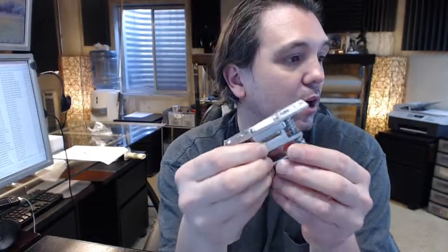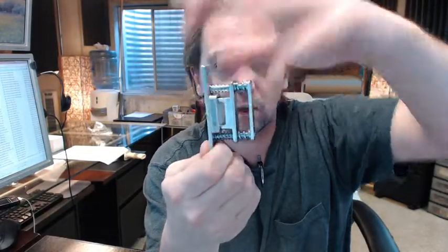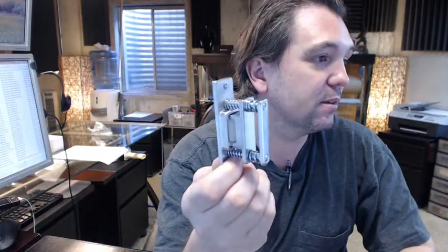Mortising for this is going to be a two-step process. If you're doing one and you don't have a router, I suppose you'll be doing this by hand with a hammer and chisel. That's not the way I would prefer to do it if I was doing the job. I would want to use a router. I'd actually have two. I'd have a plunge router set up to give me what we would call the body, which is the dimension from the underside of the faceplate all the way back, and then the width here. What you're looking at on the template is your 2 1/4 mortise height.